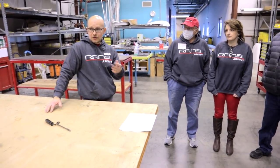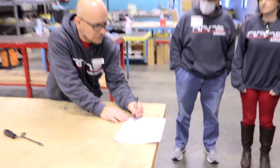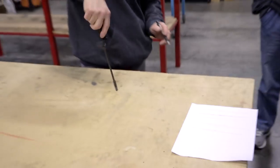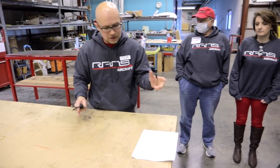So there's a lot of deburring to do. We do drill holes along the spars, along the ribs. We want to clean that out so that we don't have this effect of just debris and burrs on the inside. But when you do deburr, and there is a lot of it, it's so easy to just take this tool and just keep going. And it looks nice, but you only want to remove just enough material. So that's all I wanted to touch on as far as deburring.